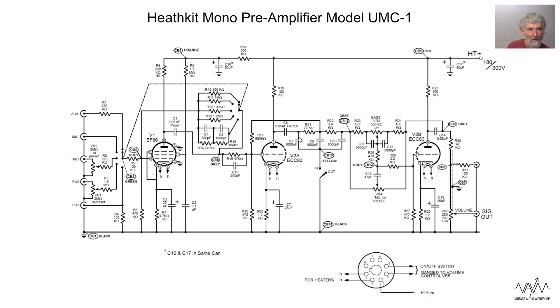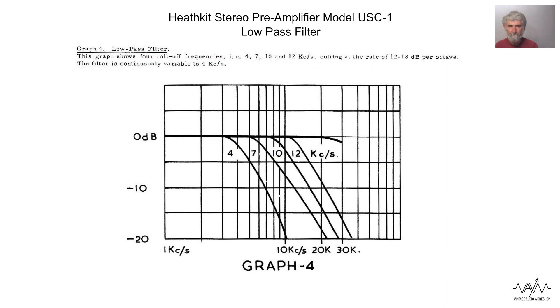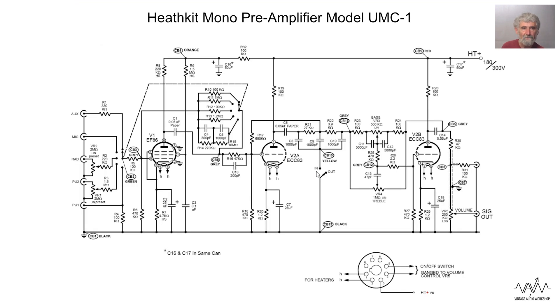When this is switched out, however, these capacitors simply bypass the resistors, leaving the circuit flat. On the stereo version, one of the differences is that instead of an in-out control, they have a pot so you can vary the slope of the filter. On this one they have gone for something simpler - simply in-out. But the actual circuit is basically the same with three capacitors and two resistors. On the input, they're relying on the input impedance from the valve to be the resistor used in series with that capacitor for the filter. Over here, we have a very famous circuit: